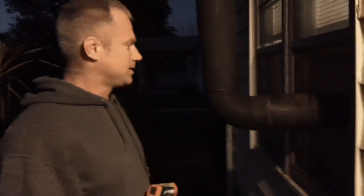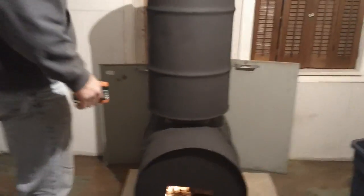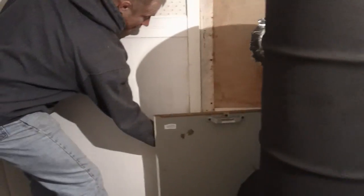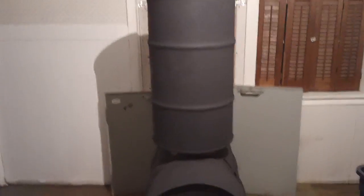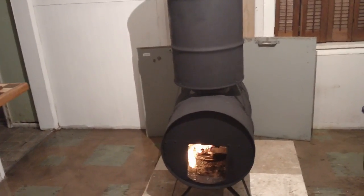I call this the double barrel rocket stove. Let's go back in and take a look one more time. It is hot — puts off a lot of heat fast. I've learned to only start a small fire in it. My wall here is just 105 degrees, so I'm well within a safe range. However, my metal plate behind is 218 degrees, which would be trouble — but the wall behind the metal plate is only 88 to 90 degrees. The metal plate is doing its job reflecting the heat away from that wall. So that is the double barrel rocket stove. The burn chamber is larger and it does put off quite a bit more heat. It does a pretty good job. Thanks for watching.